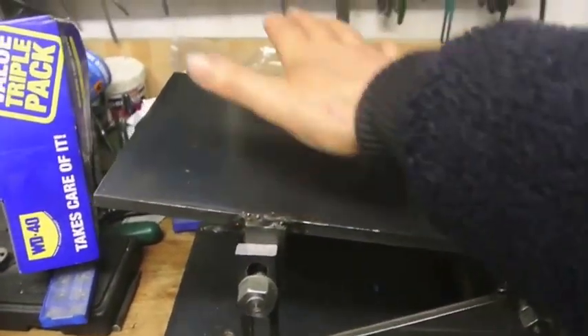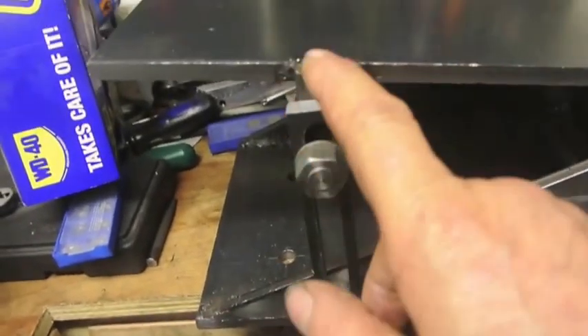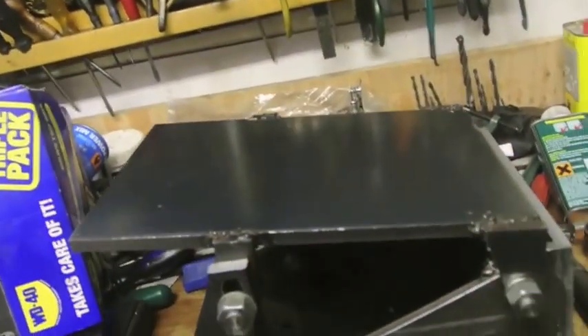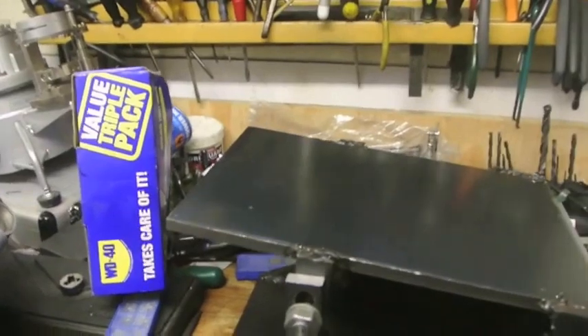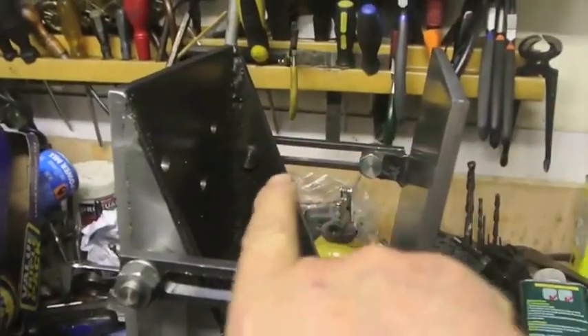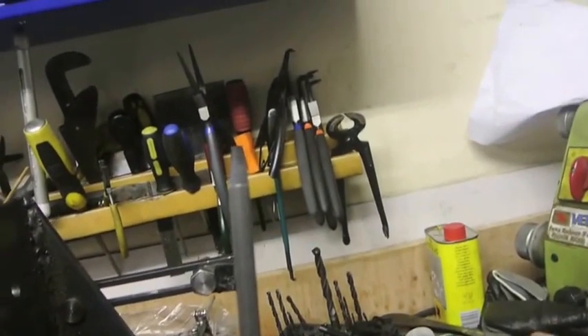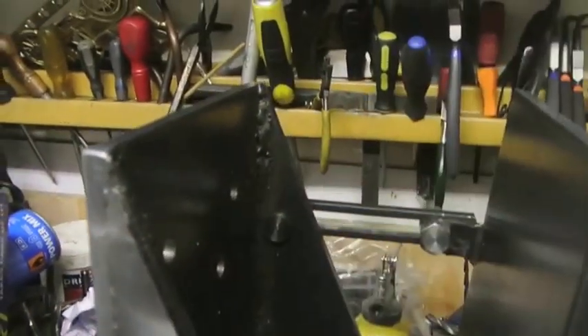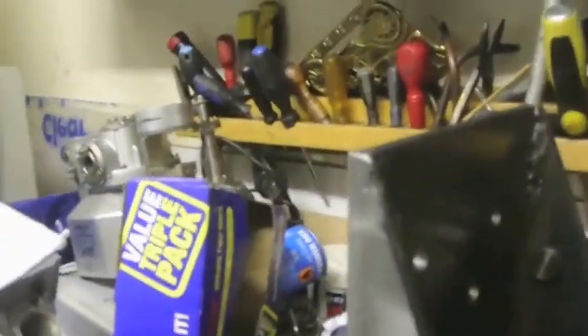There you can see what it's been aiming at - the rotary table will go on here, and it can be adjusted up and down on this slotted link. The link's a bit short to get much higher than this angle, but it will go a little bit higher - maybe another 5 or 10 degrees. The main thing for me is I want to be able to mount it in the vertical position with it set back this way, so that the axis of the table is pointing the correct way. I need it to go that way because I'm doing some hubs and the spokes come in at this sort of angle, so I need to be perpendicular.